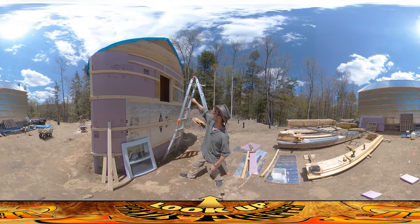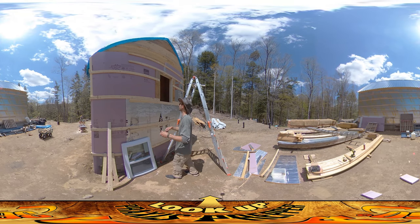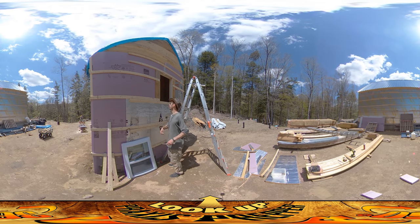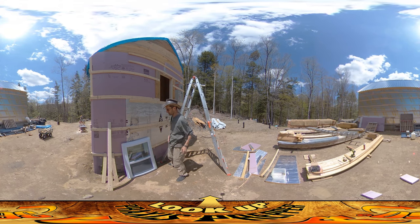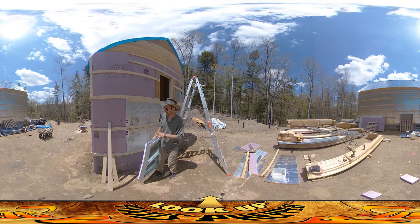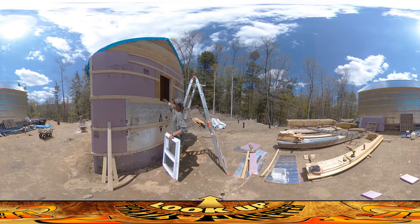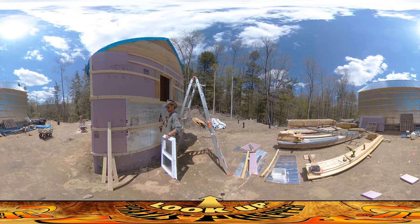Anyway, I had enough nails to get around this window and I wanted to throw it in ahead of the thunderstorms coming. First step is I got a couple of pads — I'm going to put them just on top of the foam so when I rest the window in, it's not sitting right on the foam. I should angle them so that I can grab them later on.